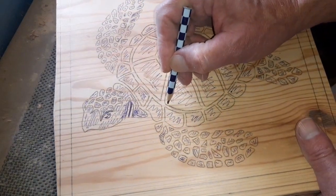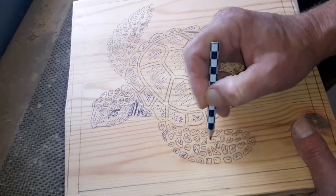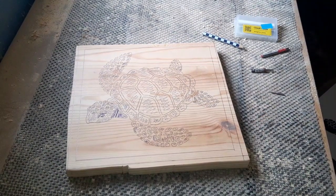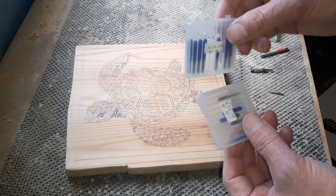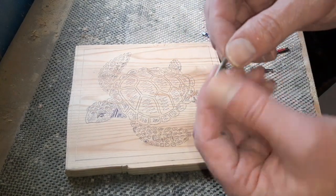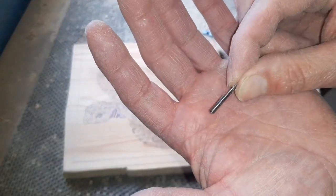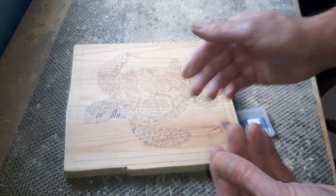So we want to go up to the lines, removing all these inner shaded bits and all those. And for those, I use CNC bits. They come in different degrees, 10s, 15s, 20s, 30s, I think there's some 6s out there. They do have a small shaft on them, a 3.175 millimeter. That will fit a Dremel no problem if you're using the Dremel router attachment,